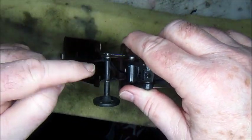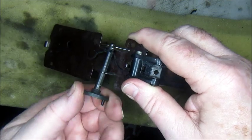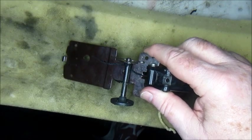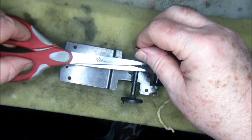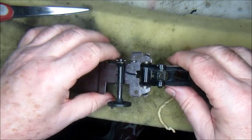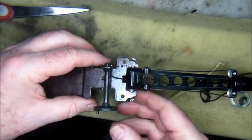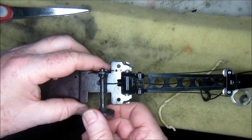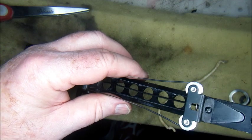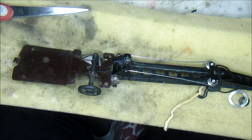There is a hole in the stem for the wheel, and what you do is put the cord through that hole and tie a nice tight square knot. Once that's done this can come off. Make sure the knot is absolutely snug and tight because you're not going to leave a whole lot of room for things pulling away. That's a nice tight square knot, and then all you do is turn this and it winds up nicely. As long as everything is lined up on the pulley, everything will work. Let's put this back together and see how everything functions.